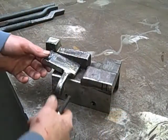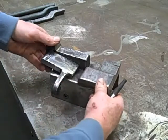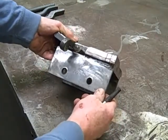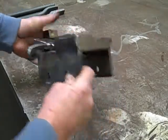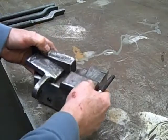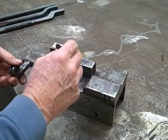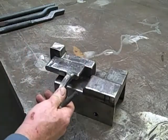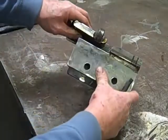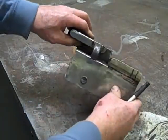This is the die that I've designed. It's made entirely of mild steel, and it's designed to fit over the bottom die of my Samax 60 hammer. The measurement of the lower die is 3 inches by 6 inches. This simply fits down over and bolts through holes in the die. This top piece is simply a kiss block, and the arm here is going to designate our offset.